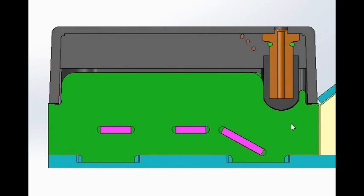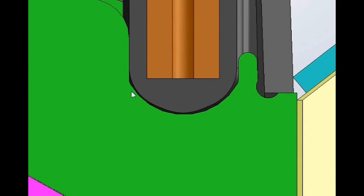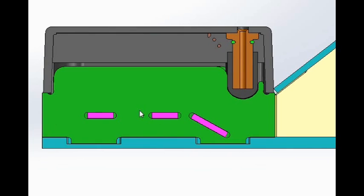Another example here with the intermediate divider — we're able to come in here and go around the vinyl caps, come up in between, and form a resting ledge. But I undercut with the 1/16th end mill so that I didn't have to come back and do any kind of sharp corner treatment. And here are the slots that align the baffle that brings the air up through the heat sinks.